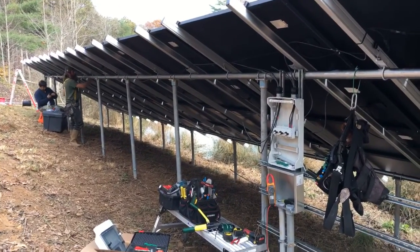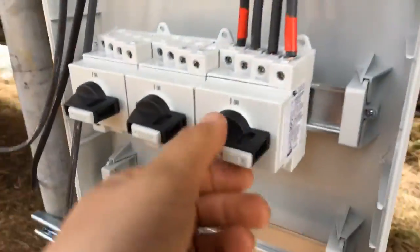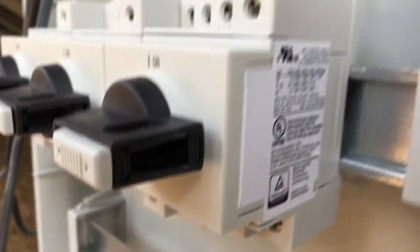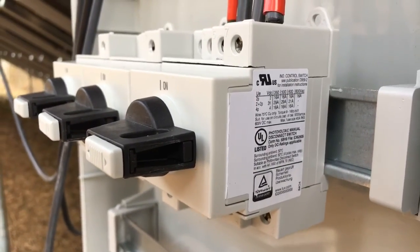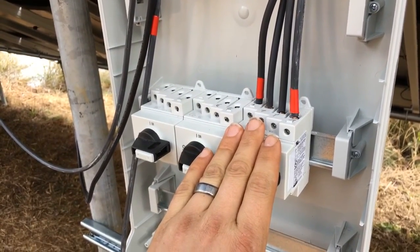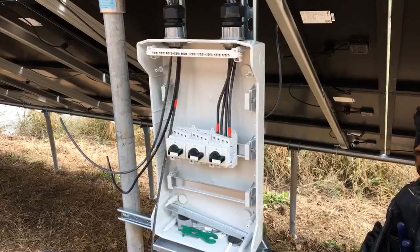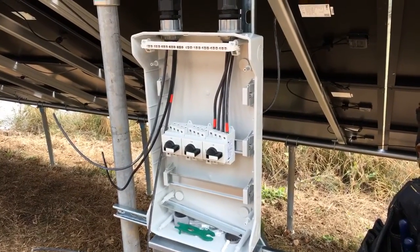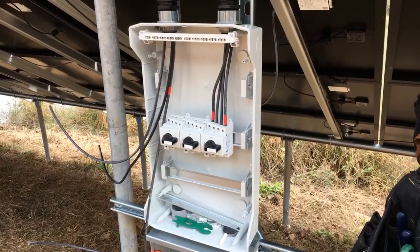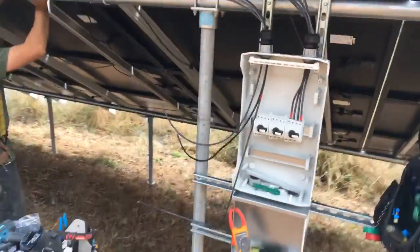So this is all about the switch — these are IMO switches. The side of the switch — it's a UL listed switch. They're made in Austria. This one is good for 16 amps at 600 volts. This is a box I got from Industrial Control Direct, and I can mount a lot of disconnect switches in here. It's a nice little AC disconnect.